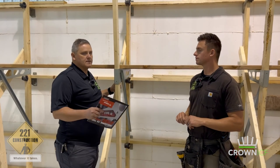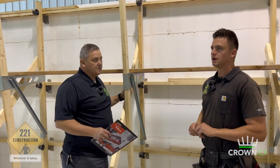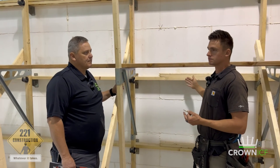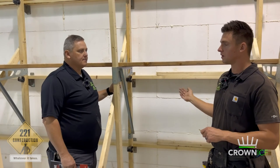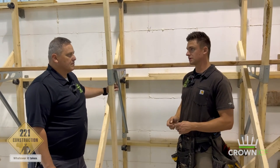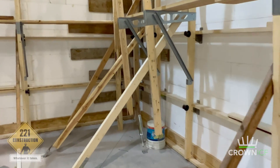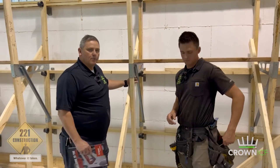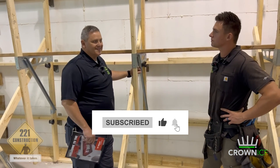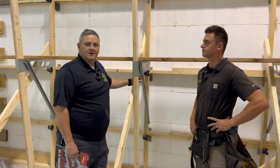This is maybe a thousand block — how much faster do you think this system is, compared to doing it all with lumber? Two or three times, maybe more. To give you a picture, we used to stiff-back every horizontal, installing screws on all the stiff-backs before putting them on the wall — not only screwing the two-by-four as a stiff-back but anchoring it into the web with two screws typically. So this is probably three to four times faster, or more, than doing it the other way. We'll probably do more in-depth videos about how this all goes together, what goes in first, and how you line things up, so stay tuned.